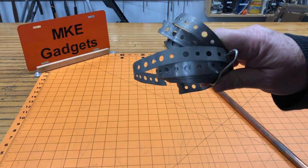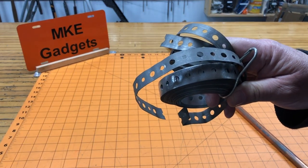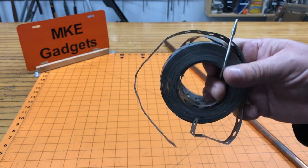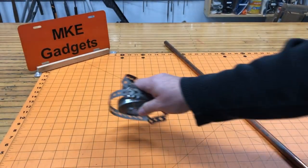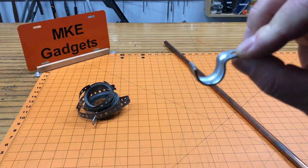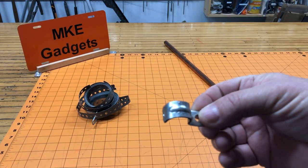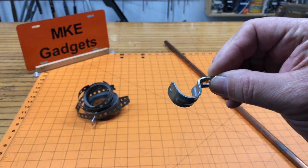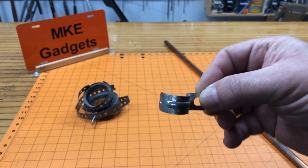You can go to a mega big box store and get this metal strapping. It's easily cut with tin snips and has all these holes for screwing it to the ceiling, but I don't think that's gonna look very nice. This style clamp has one screw — you put it under your copper tubing and screw it to the ceiling. But this is harder to work with when you're by yourself because you've got to hold the copper, your screw gun, and a clamp, so that's not gonna work.